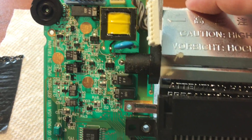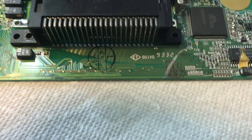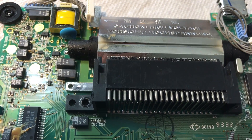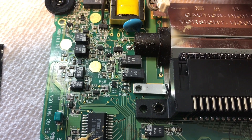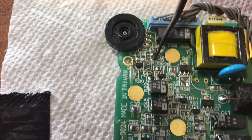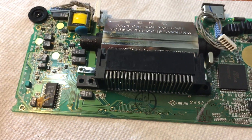Next step is removing the transistors — I'll call them Q-chips. We're removing three of them: Q4, Q3, and Q6. Q3 is located under where the L2 coil was. Q4 is on the other side of where the L2 coil was, and Q6 is this tiny little black chip here. You can also go back and double check with the schematics if you're not feeling confident. We finally got off the transistors — holy crap are they a pain. At least Q4 and Q3 needed a bit of work, but the board is now clear of them.